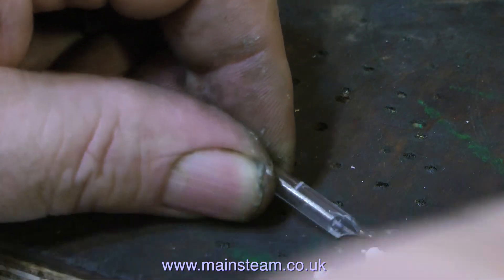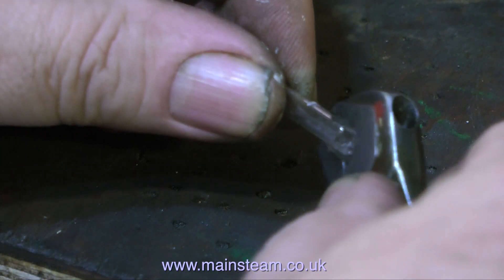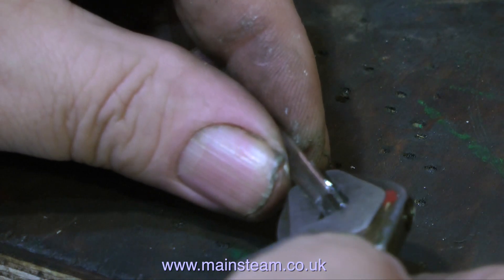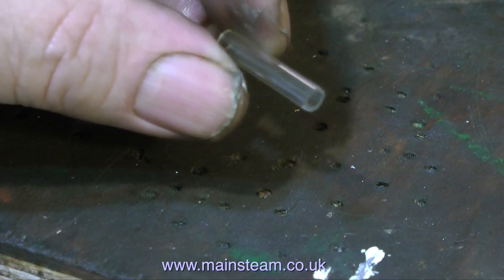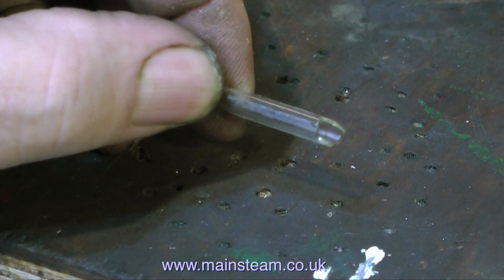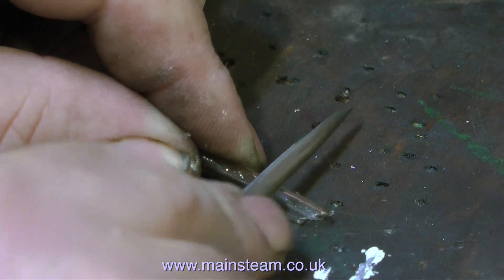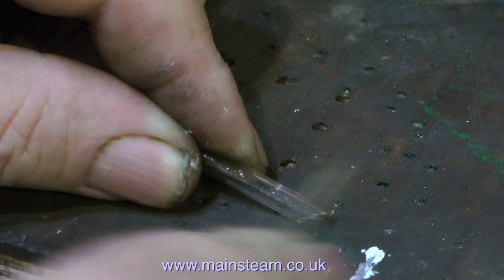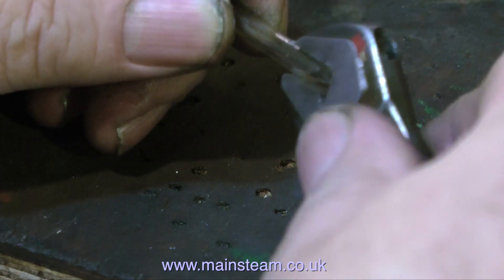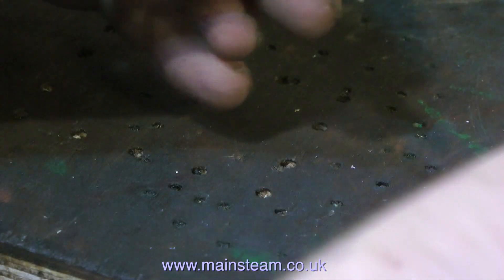Now the black art of cutting glass. These are some random bits of broken gauge I've got in a box. How I normally cut them is to use a needle file and just file a small nick in the glass at the top, then use my adjustable spanner to snap it off. So it's a quick file with a needle file — just a little notch, and you don't need to file all the way around, just a notch at the top. Then I use my adjustable spanner, fully adjusted to the diameter of the glass, to snap off the piece of glass. And as you can see, it comes off clean.